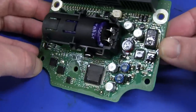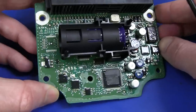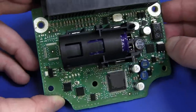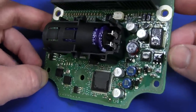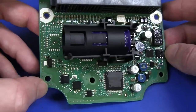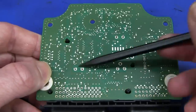Conformal coating is very common in ultra-high reliability devices like this because it keeps out the moisture from the board and ensures that it works over a huge range of climates. Who knows what climates these airbags in different countries face — many different varying climates. But yeah, it's not a full conformal coating. I'm a bit surprised it hasn't been completely gunked. The big capacitor there is rather interesting. That's the device on the bottom that had the press-fit pins. There's no electrical connection on those ones, but there are the two pins for the cap there.